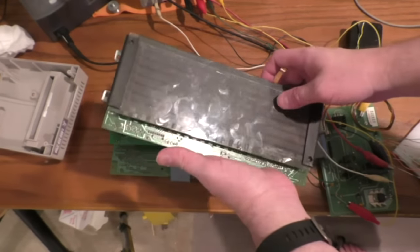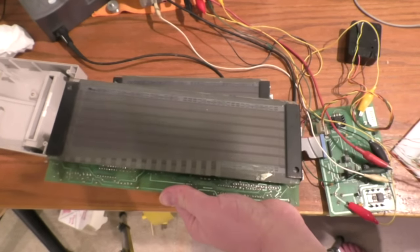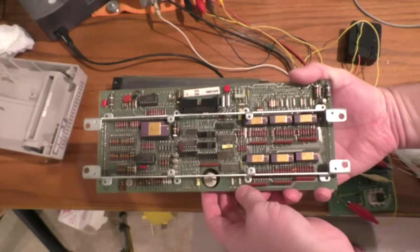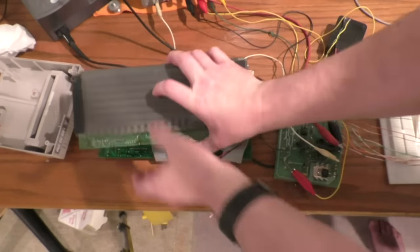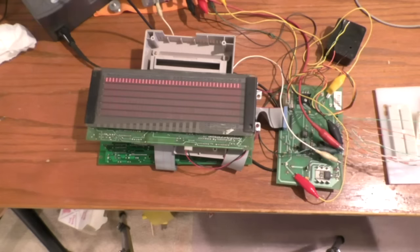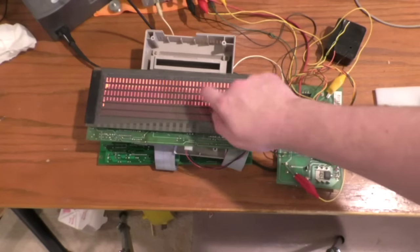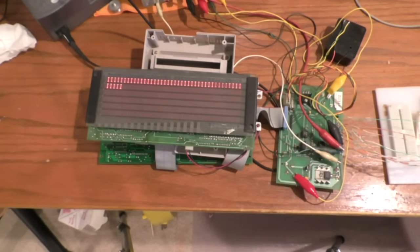This is the fourth glass - I've tested it and it does have problems. You can see burn-in here, and it's kind of flaky. I don't know if the tube itself is bad or if this driver board has issues. The display sits upside down, the NES shell goes on top, then the glass goes on. When I bumped the 5 volts up a little it started working better, but as you can see it's still fairly messed up. When I start typing it seems to recover, but typing '@' which is hex 40 shows up as 'H' because H is hex 48.